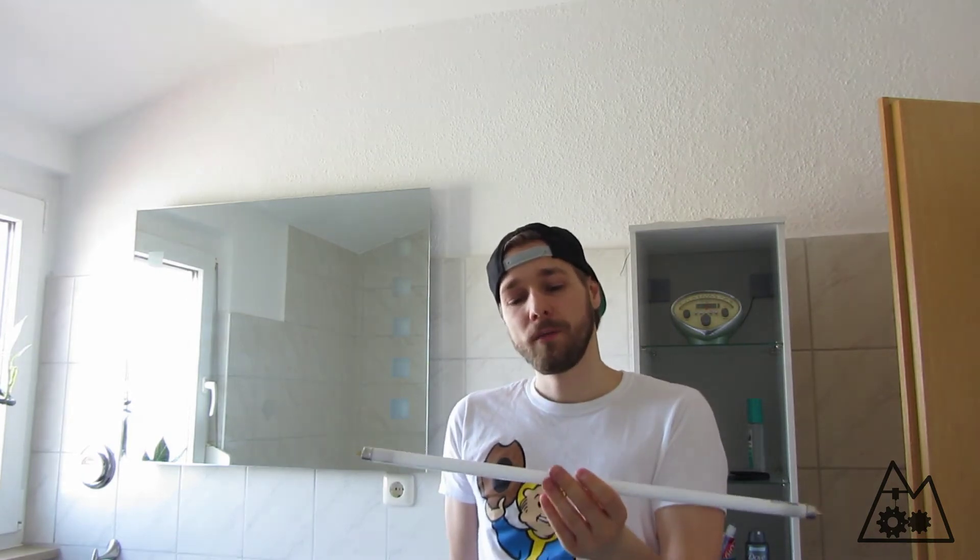We are ready now — the mirror is installed. The reason for the upgrade is that those fluorescent tubes break every 3 months, probably from the on/off switching every day. They cost about €5.50 each, and this is the third set I've bought — with two tubes per mirror that's about €30-40 already invested. Now I bought this LED strip which cost about €22, is rated for humid environments and outdoor use. This will last forever.